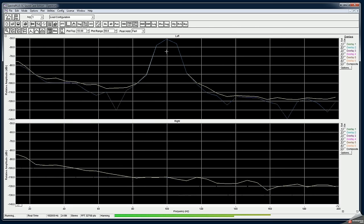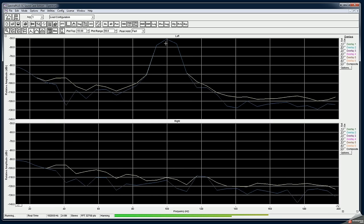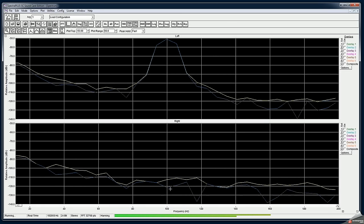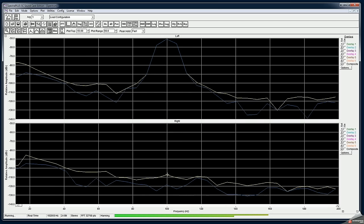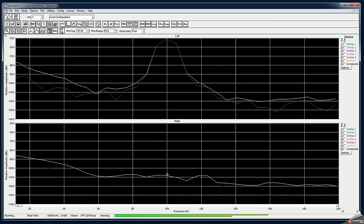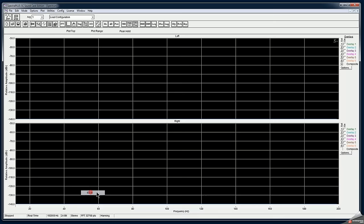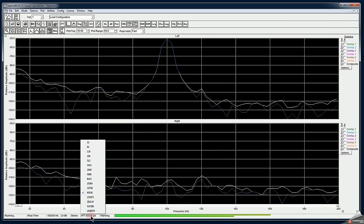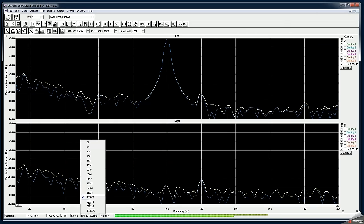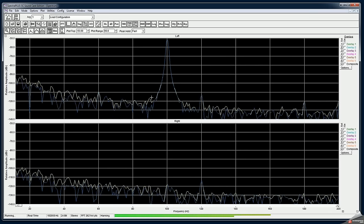As you can see here, we have almost the same result as we had with 1 kilohertz, which shows a signal level of minus 50 dB. Again, this is very relative. And it doesn't show any crosstalk inside the device. And if I plug in my own setup, my cables and everything else, it doesn't show any crosstalk either. So this is very coarse, so I can actually try to get better results by increasing the number of samples that we are looking at for the Fourier transform. Well, this looks better.